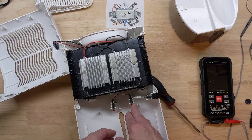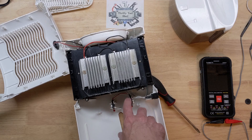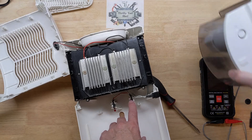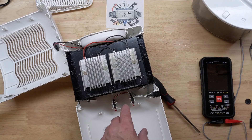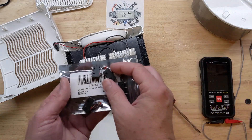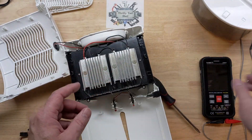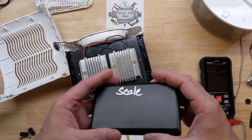Here are our switches, and it's pretty easy. This is a very simple thing — with a bucket in place and the float being down with no pressure on it, they're normally closed, so the switch should be made. I got about 10 of these switches in — they were the same type. I thought I did good finding the exact same switches and ordered a pack of 10 at a really good price, but there are two issues with these switches.